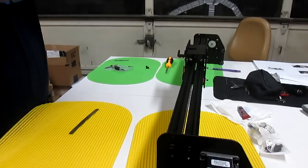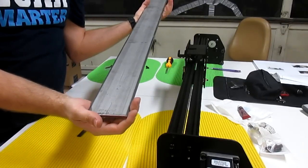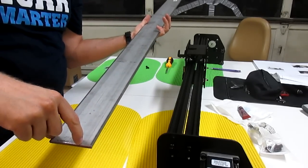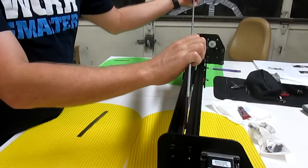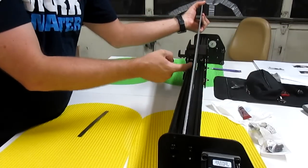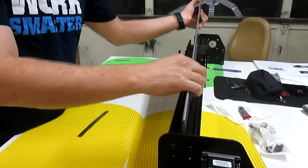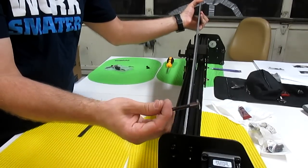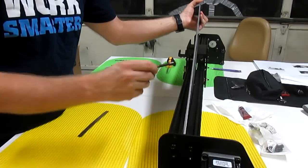One way to stiffen that up is to get a piece of 3/16ths inch steel — I got this piece from Home Depot. You cut it to size, slip it in here going all the way through and underneath, drill some holes through the maker slide and through the steel, and hold the whole thing together using a furniture nut and bolt. There's a low enough profile that it will suck everything together and won't stick out or get caught by any of the screws.